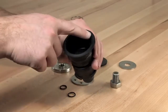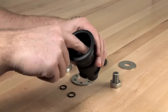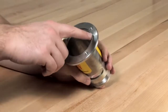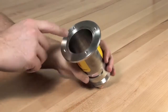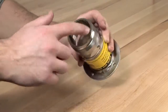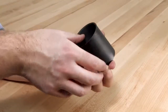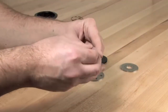Inspect the diaphragm for any debris, tears, holes, or excessive wrinkles. If the diaphragm is damaged in any way, a new piston diaphragm assembly should be installed. Thoroughly clean and inspect all surfaces within the relief valve body. Should you discover any nicks or damage around the seat surface, the body should be replaced. Finish by inspecting the components of the piston assembly and the sleeve for any significant damage or debris. Clean and replace as necessary.